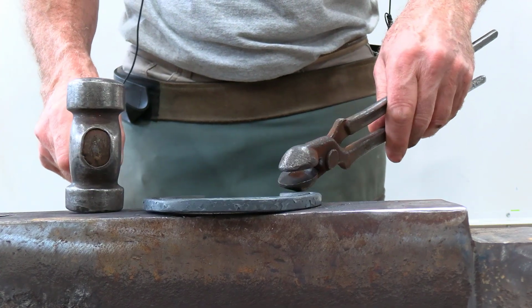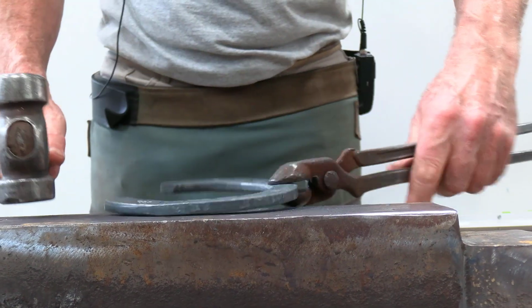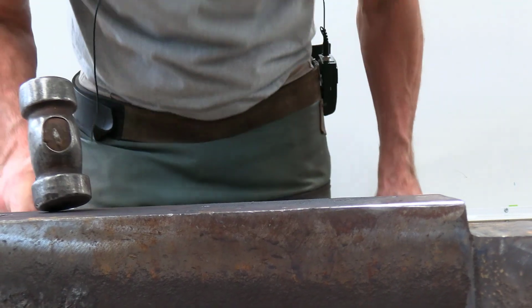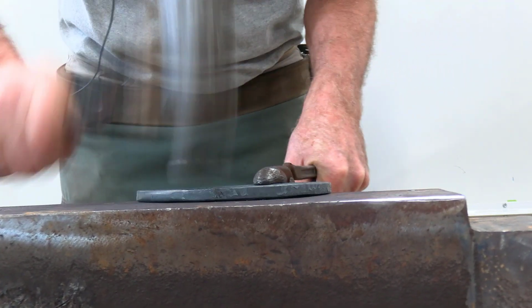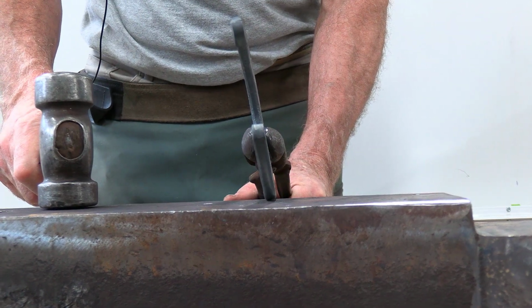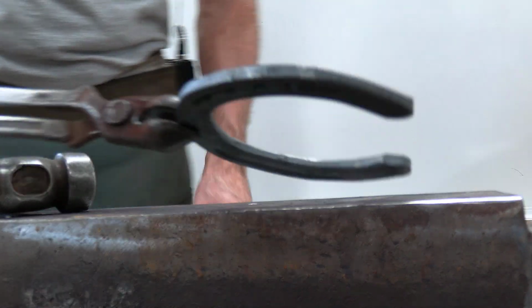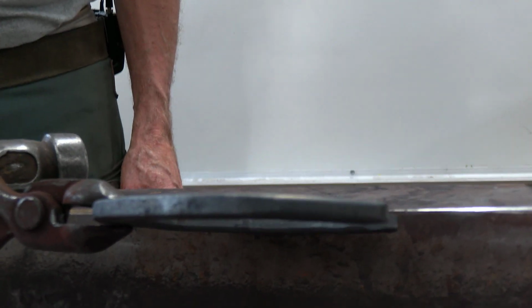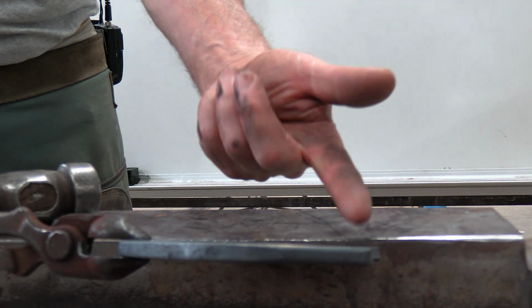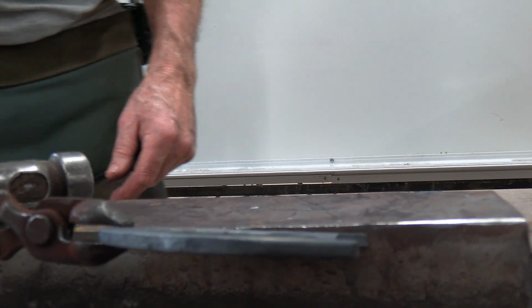My shoe's getting flatter. I still have a problem here. So this heel is bent away from the anvil. Turn it over. Now I have a gap through here, and repeat the process. My branches don't quite line up. Let's see if you can see that. Can you see that? You're looking down on it, and then change it so it's just one horizon. This heel is slightly this way to the foot, or that heel is away from the foot, is how I would see it right now.